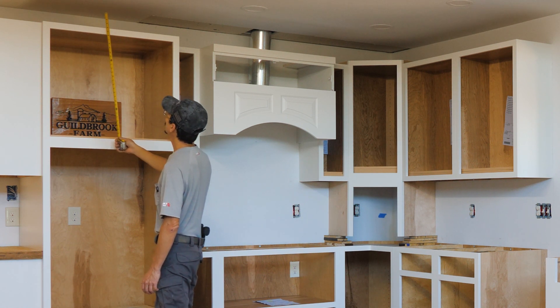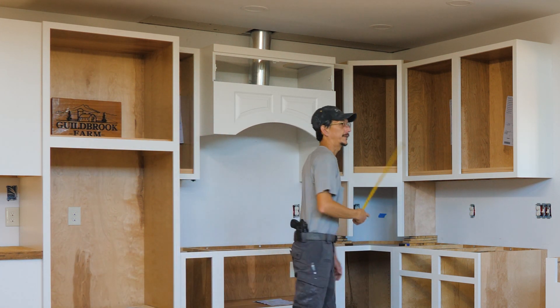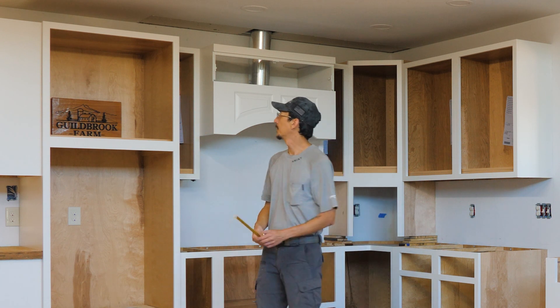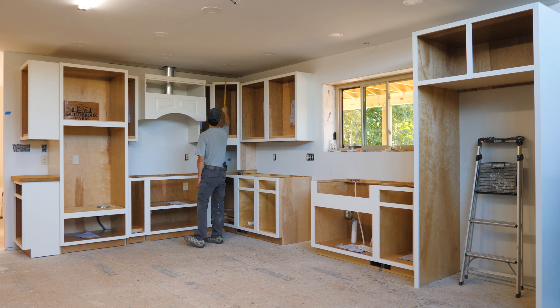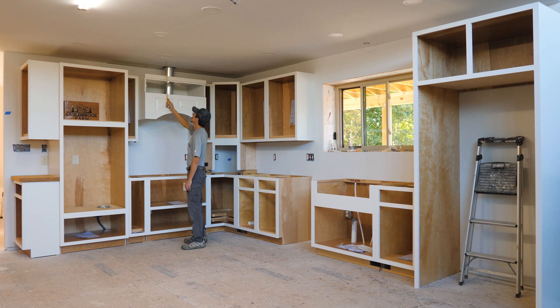From there I'll crown the top of that to the ceiling. I have to go dig out all the pieces of slab board, find them in my boxes, and figure out how I'm going to do this. Typically I would put a furring strip — like a one-by-two — along the line here and attach the slab to that if it were full height. But because I don't have a full-height piece, I have to attach it directly to the cabinet face frame.